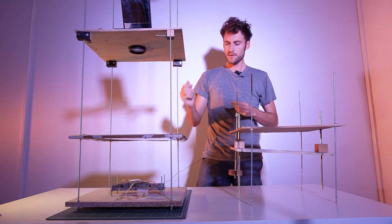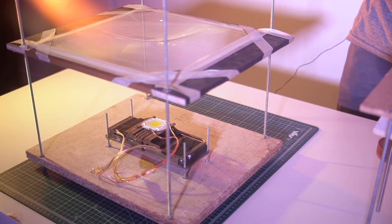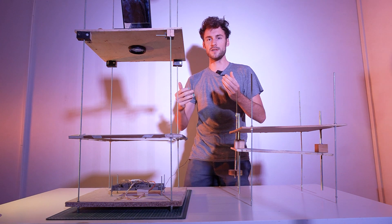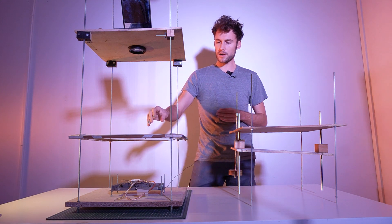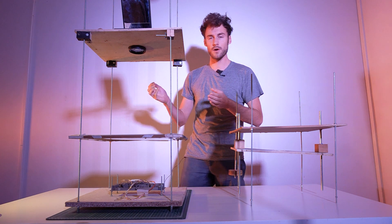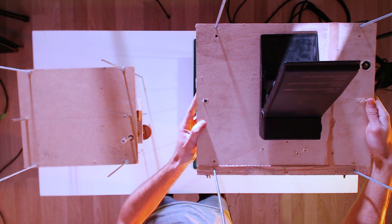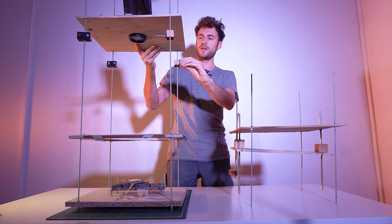In this prototype, we had a few issues and possibilities we wanted to explore — it has a lot of good things, but also problems to fix. So why should we build something from scratch instead of just doing a projector conversion with LED? The goal is to be able to do any modification after. I took parts from an existing overhead projector and tried to remake its functions. For example, I did a very simple but not efficient yet system to do the focus — I have to push with my hand to find the good position.